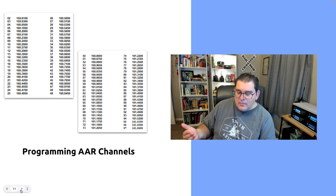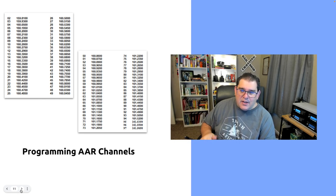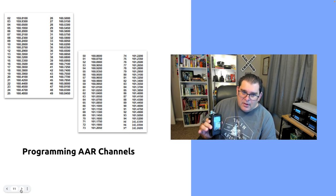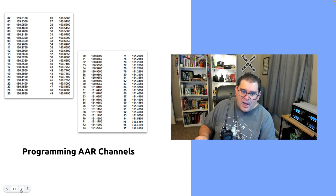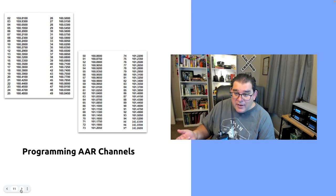The great thing about it is this is a service search inside of the scanner. The scanner does have a service search, but I would strongly recommend programming it the way I mentioned, taking the first 97 channels and programming all 97 channels there. You're able to hop to a channel on the fly. So if you hear them say, all right, can you talk to me on 55? You can go, oh, okay, I'm going to go to 55 and listen right in.